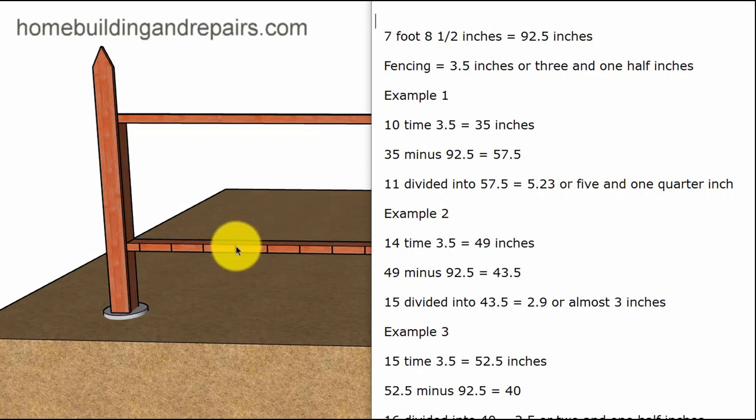That's going to be a little too wide for this type of fence. You could always do three and a half inches — if you have three-and-a-half-inch wide pickets, you can simply put a three-and-a-half-inch space in between and then another picket. That actually works. So with Example 1 we'd have a five-and-a-quarter-inch space basically, and eleven units.